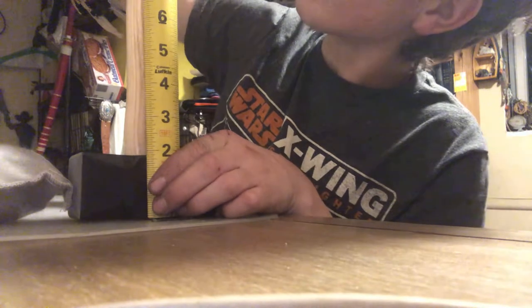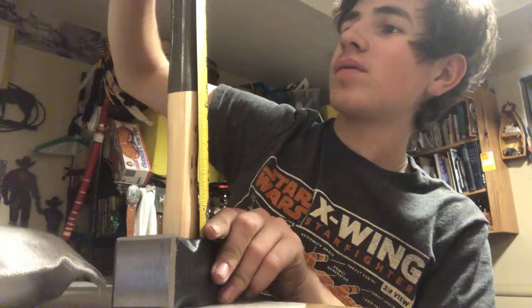That's the surface finish they come with. I kept this one rough because we're going to be using it for striking punches — that rough head keeps a little bit more friction so it's not sliding off as easily. Also, when I finish them they get a little more rounded, and we just want to keep this one flat. The handle length from the bottom of the head up is just about 11⅛ inches, and from the top of the head down it is exactly 9½ inches.